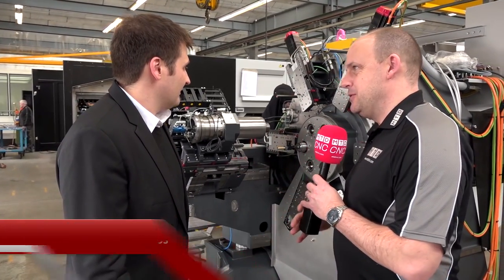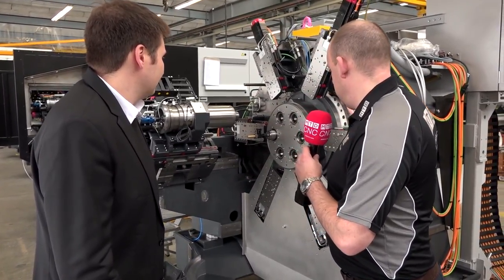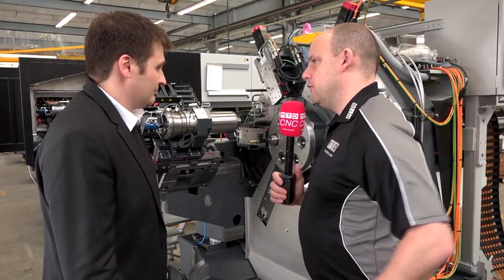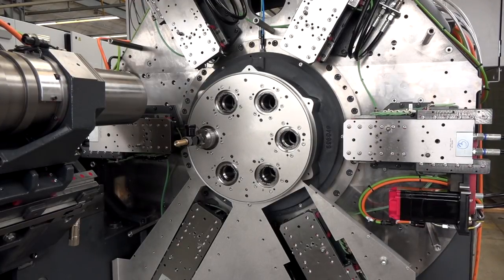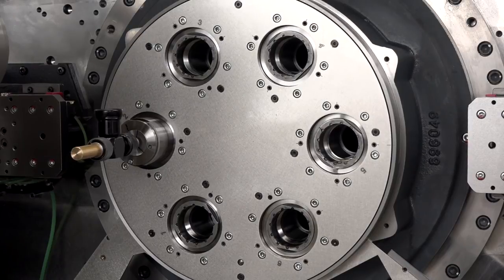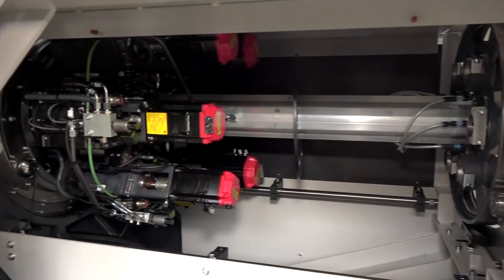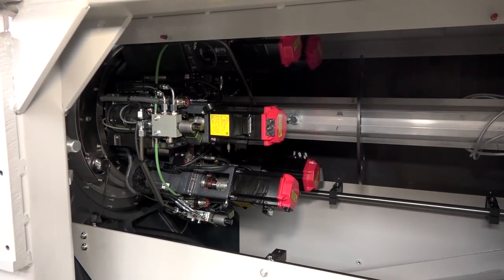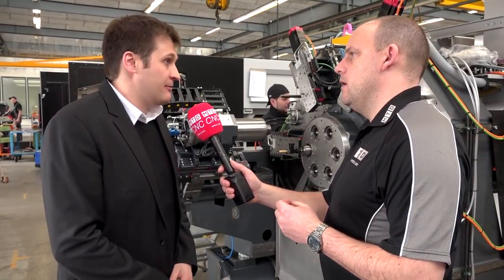It's great to see the machines like this because it really shows you how the machine is put together. Let's talk about the spindles here and where the tools are housed. We've got six spindles in the barrel, seven with the counter spindle of course. The main characteristic of those spindles is that we have a hydrostatic bushing in the front, with standard ball bearings in the back. Therefore the core of the spindle is always at center, minimizing tool wear and providing very good dampening.